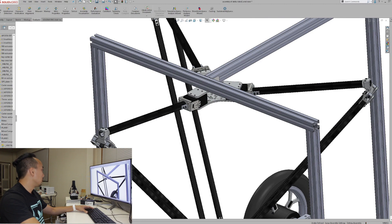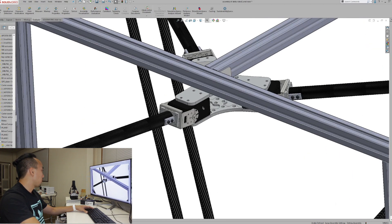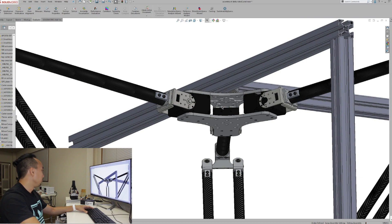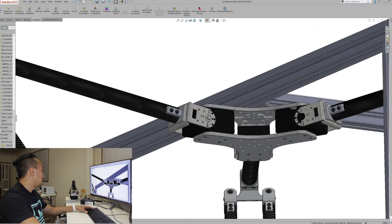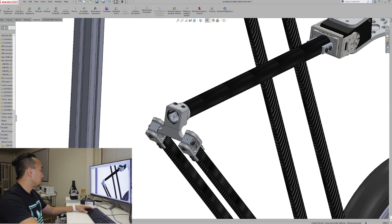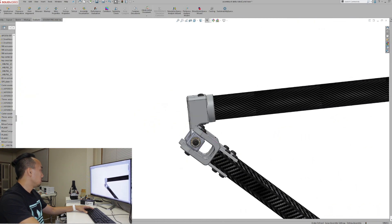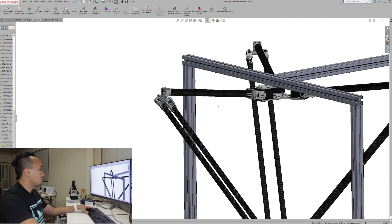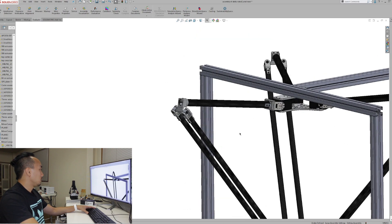The base platform of the robot is just two aluminum plates attached directly to the servos, up and down like this, and attached on the rover frame. These are standard parts from Robotis — the servo horn and servo bracket. We designed our own universal joint from a small aluminum cube. It also has a joint offset for the proximal and distal links, which increases the workspace a lot and avoids interference between links. Before we were using a standard ball joint but the workspace was very limited, so I redesigned my own and now it can go much wider.